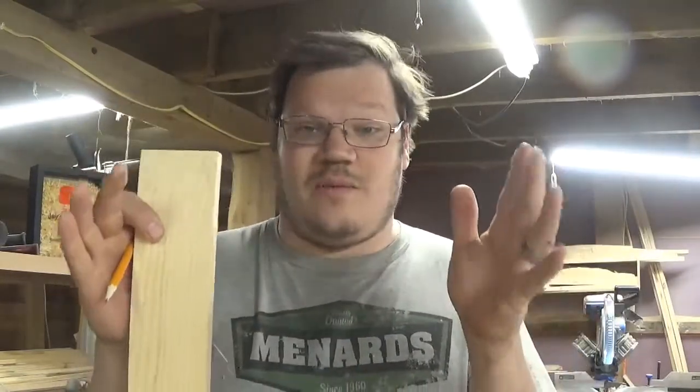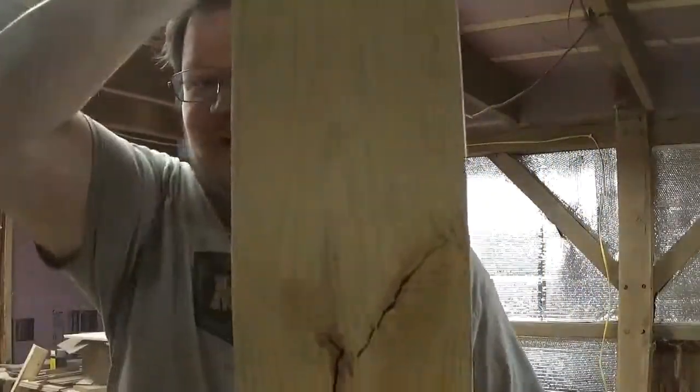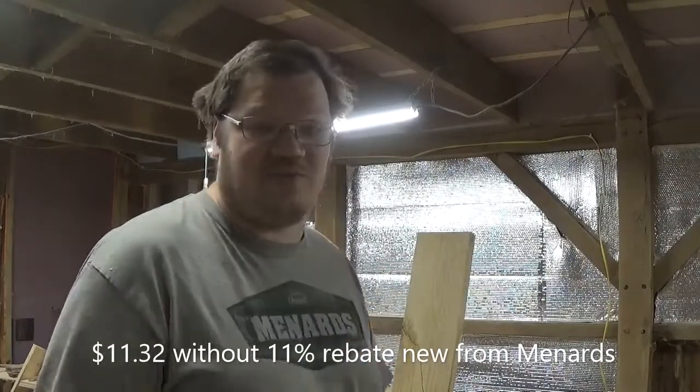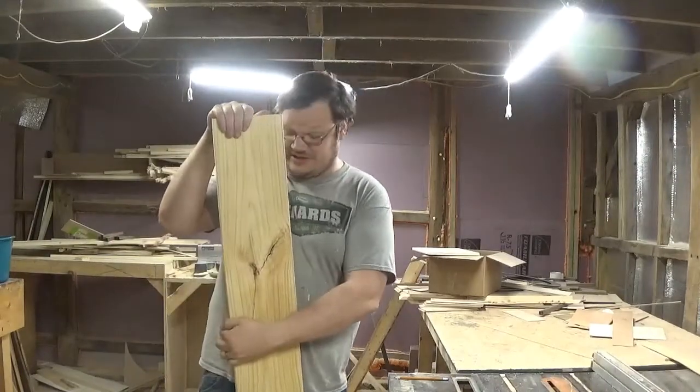You're going to want to look at wide lumber — 1x12s, 2x12s, or something along those lines — and get the part out of the middle. I've got a 2x8 here that was actually given to me from Menards. Being 2021, lumber is gold. They gave me this 2x8 because it has a structural crack right there. I got it for free, and it's the prime example of what you want for cheap quarter-sawn lumber. I'll put the value on screen to compare quarter-sawn value versus what it would have cost without the crack.